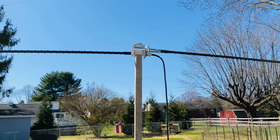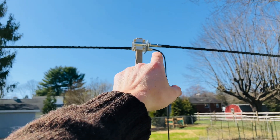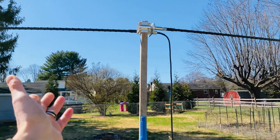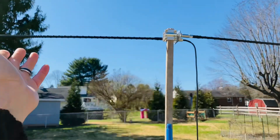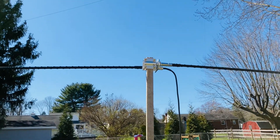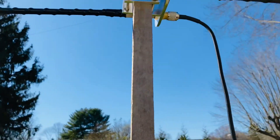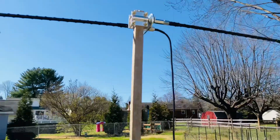With 102-inch steel whips I wouldn't recommend the spring at the bottom — they are going to sag a little bit and take up more space. You'd have eight feet each side, that's 16 feet total. But with the hamsticks, even the four-footers, you're only looking at eight feet — in this case I've got six feet plus the MFJ-347 in the middle. It's fed on one side as the hot side, and the other is your non-radiating element.